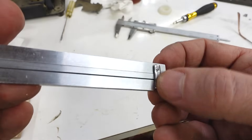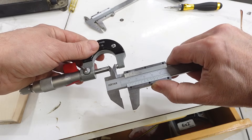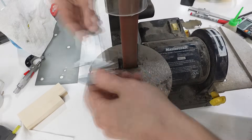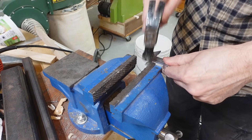I managed to screw this little bit all the way on. I examined it and it turns out one of the holes wasn't tapped all the way through, so I just counter-bored it to cut away the unthreaded part and now it's on there flush. The inside measurement on this thing was about 0.2 millimeters low, so I ground these tips back a little bit — but now it reads 0.12 high at the very tips, better further back. I just ground away too much. This would all be so much more complicated if I was a machinist. So I'll see if I like using these as my new shop calipers, and despite the quality of the raw material I bought another pair because they're so much nicer to use at my desk than plastic calipers. These ones I'll save for metalworking because they can scribe hard material with a carbide scribe, and that way hopefully I won't drop it so much.